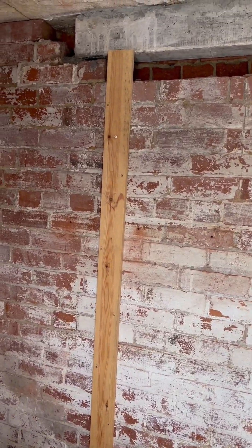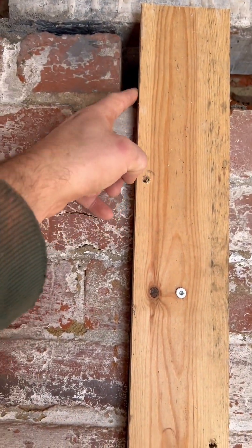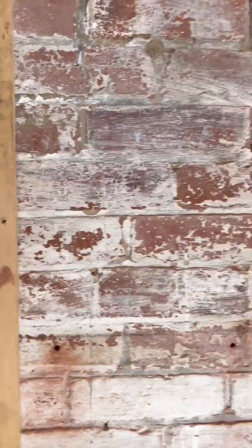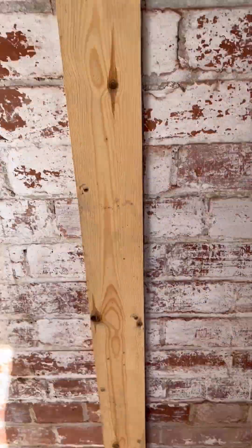So let's get on with it. In here I put a couple of guide rails up — that's my line there. It does go off the brick a little bit, so I'm gonna try and build that out, but I'm gonna go down here with the angle grinder, and the same on the other side. Just use a small angle grinder there to get a start, and we're gonna run the angle grinder down that.